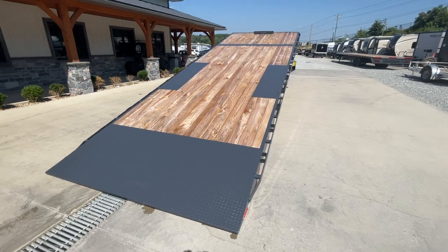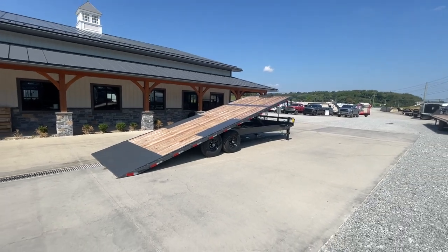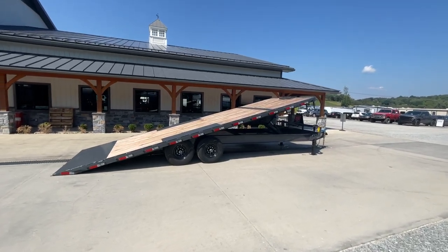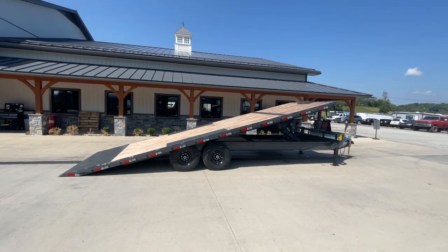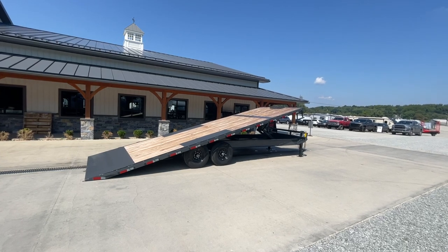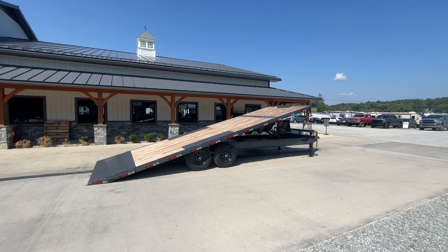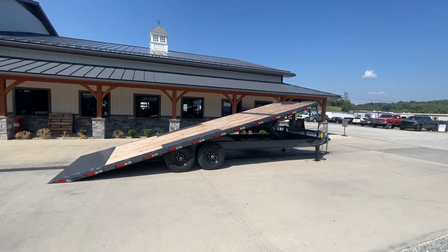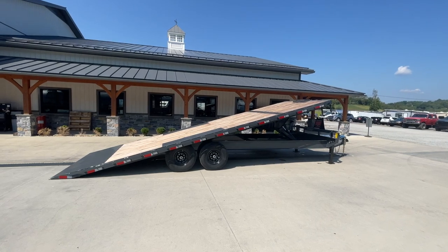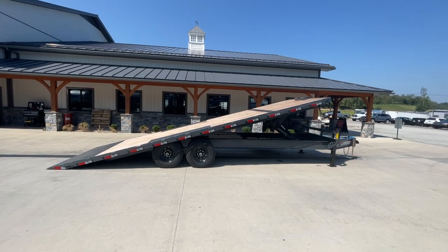About a three and a half foot tread plate tail on this. The tilt angle on this is going to be a little over 15 degrees. Industry norm is somewhere between 15 to 17. Sometimes in the industry you'll see 22 footers, but Lamar goes 24s and 26s mainly — so maybe a little bit longer than some. Part of that is just that it's a bigger, heavier duty trailer. Your 22s are a little more lighter, and on 22s your axles will get slid almost completely to the center point. The 24 and 26s allow you to have that pivot point just a little bit farther back.